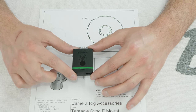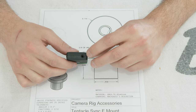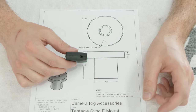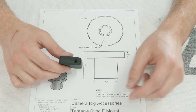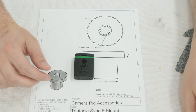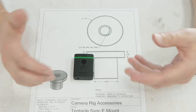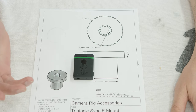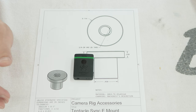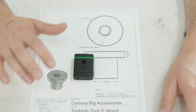What I have in front of me here is a Tentacle Sync E, which is a linear timecode generator. What you do with this is you plug a 1/8 inch audio cable into it, and then the other end of the cable into any type of audio gear that has a 1/8 inch input. So what this lets you do is, if you have multiple of these, or you have a camera that has timecode in it as well, or an external audio recorder, when everything's running the timecode and it's all synced up appropriately, you can just take it into an appropriate video editor, and the software will automatically line everything up